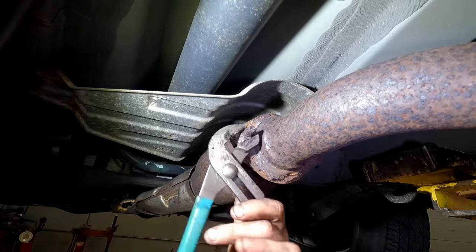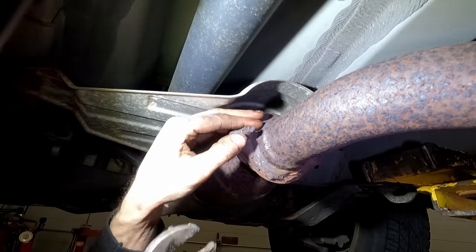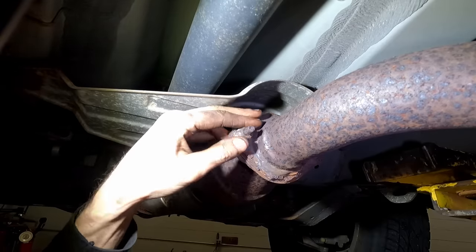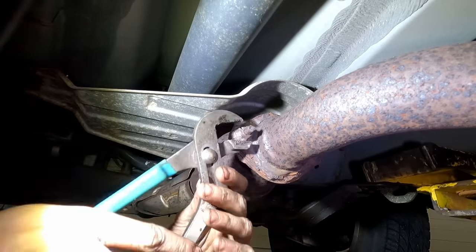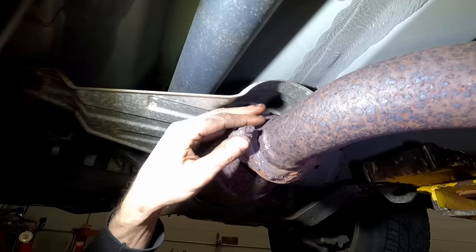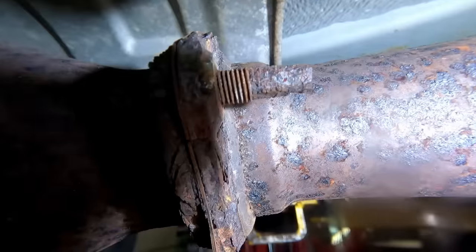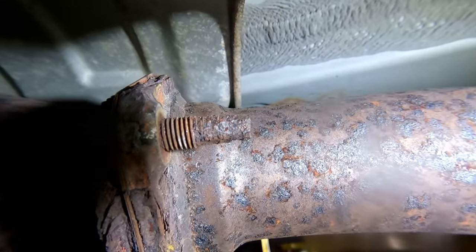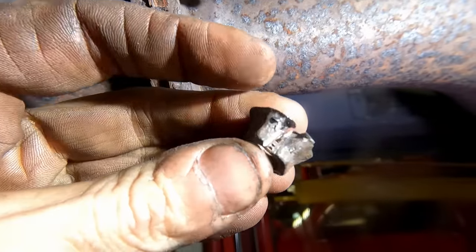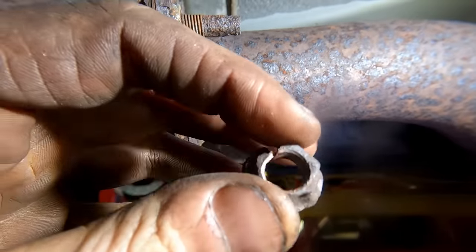I can come in here now with a pair of pliers, open these up a little bit, and I can practically take it off with my bare fingers. I'm literally unscrewing this super rusted nut with my bare hands. Wait until you see how perfect these threads are on the inside. As nasty as that was, you'd never think that you could put a nut back on this when you're all done. Look at how nice those threads are — they are perfectly flawless. You could put a nut right back on there and draw that tight. Here's the nut we took off — you can see we carved a groove, split it wide open, and cracked it loose.